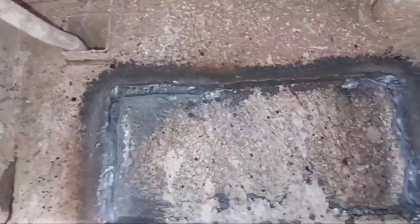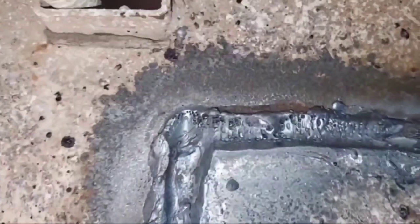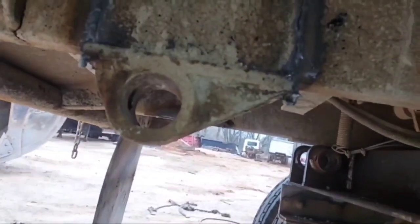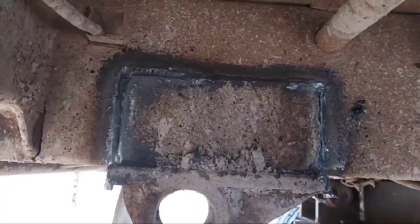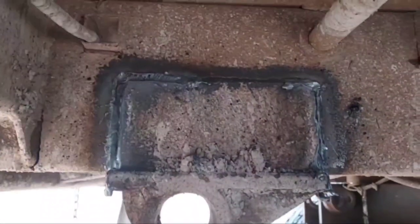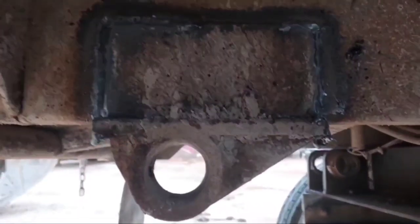That, in a nutshell, is the reason why I'm always out stick welding and not running wire on everything. The wind got to the feller that put that on at the Oxbody factory, and the quality control people didn't care enough to make him go back and cut his garbage back out and redo it. So here I am having to cut it out, and it'll get redone when I put the new hinge on. It's amazing to me that it lasted as long as it did, but here we are.